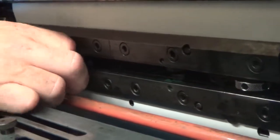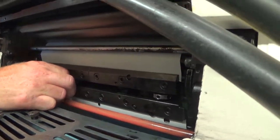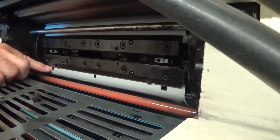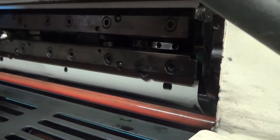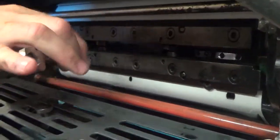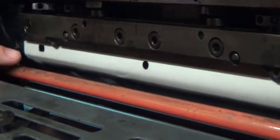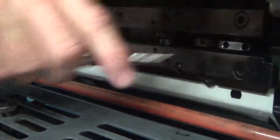By tightening these bolts I'm stretching the plate and pulling it tight to the plate cylinder. Right now it looks rounded — I want it to look like there's a seam and it's creased. I'll tighten: one, two. You can see the seam is starting to crease, so I'll come over here and do the same — one, two — and now I've got an even crease all the way across. I'll give it one little nudge on each side.